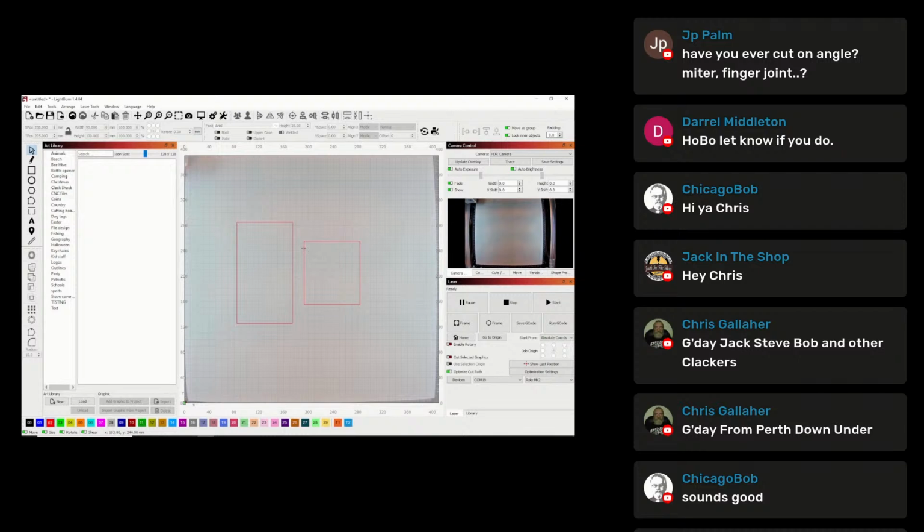So this piece here, like I said, is going to be the leg that's going to go out the back. And if you want to spruce it up, make it look cool, the way that I would do that, because first of all, this piece can't be as wide as this if I'm going to insert it through there. So I've got to decide how big I want the little slot to be. I do know from my calculations that it needs to be about 25 millimeters off of the base in order to give me the right angle.